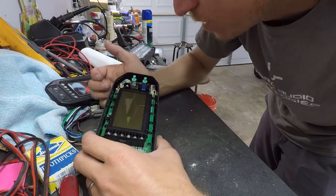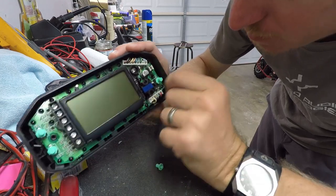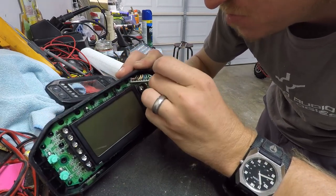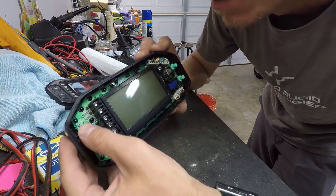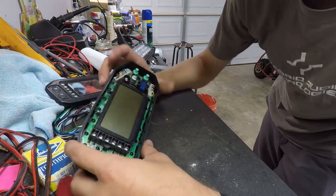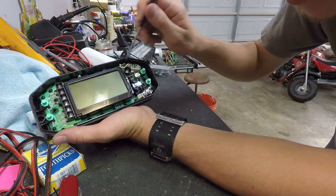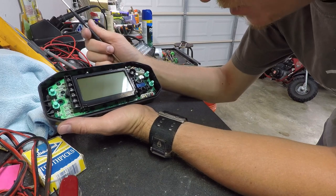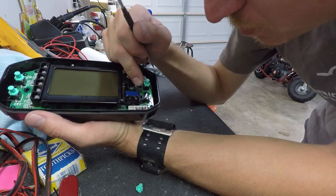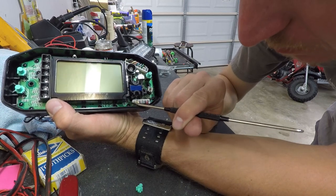Right off the bat I don't see anything too terrible. There are a couple of diodes that look a little bit singed but overall look fine. The whole PCB is heat-riveted in on these black dots — just molded over, hot-pressed in. This main cap on the input side looks a little tinted but it's solid, pads are clean. It almost looks like there's a small voltage regulator right there, transistor-based style.